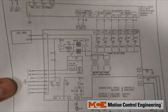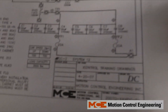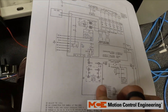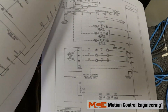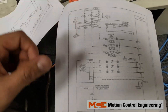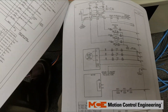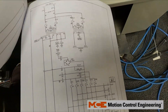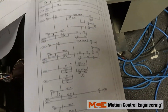For those proofing faults, you will most likely be troubleshooting on page D1 of your controller prints. That covers motor contactor driver proofing fault. If you have a brake proofing fault, you'll need to go to page one of your controller prints.